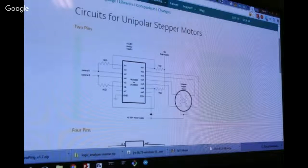Yeah, so a DC motor just has two connections, and the polarity, when it's attached, determines which way it spins. That's why the H bridge used here is convenient on a DC motor: it lets you electronically change that polarity. If you're using a circuit like I did for the LED lights, you could get it spinning forward just as easily, but then reversing requires something to switch it.